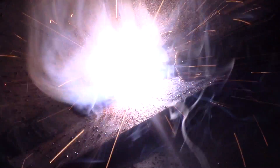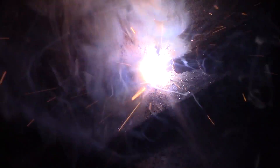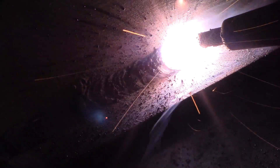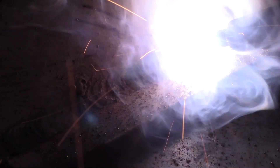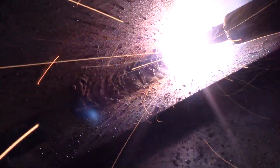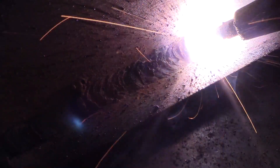FluxCore does alright — it's not too picky about metal cleanliness — but it's always a good idea to prep your metal. I wire-wheeled all these pieces; you can also grind them. And make sure between welds that you clean where you're going to tie in. I use this file the way you would use a chipping hammer — I like using a file. I teach and I have to hear a chipping hammer banging on metal all day from students, so I try to avoid it when at all possible.